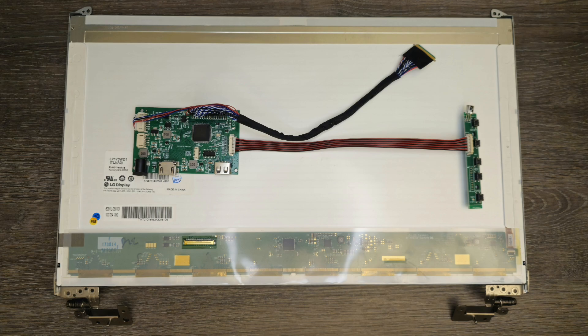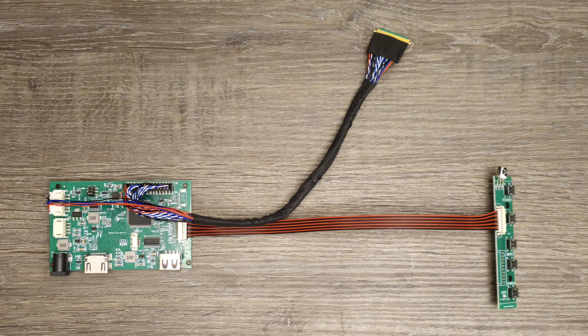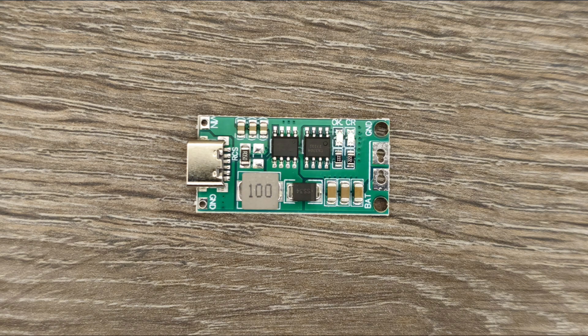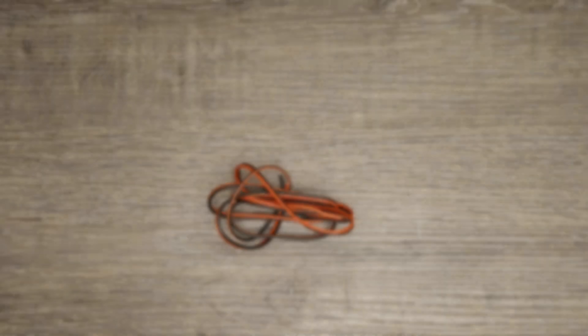But I want to make something more sophisticated, which is why I'm going to use some more parts from the laptop, and I have even ordered additional components. My plan is to make a portable monitor with an internal rechargeable power supply. Here are the parts I will be using: one LP173WD1 screen with the metal frame and hinges still attached, one LP173WD1 compatible control board, four Lithium-Ion cells from the old laptop battery, a case to house the cells, one Lithium-Ion cell charger designed to charge four cells connected in series, one adjustable step-up/step-down DC to DC converter, and cables.